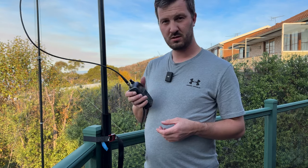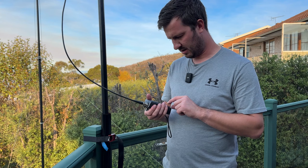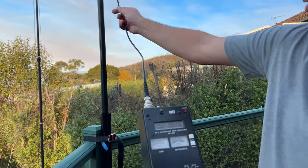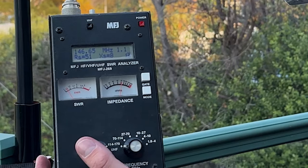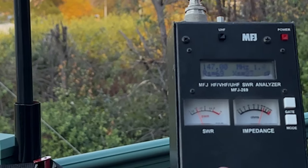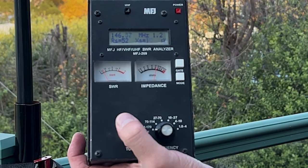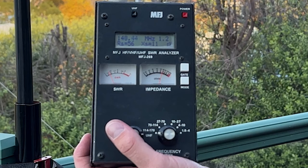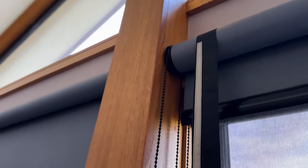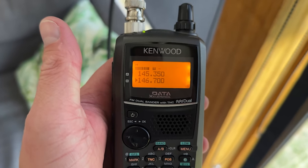That works. Testing — I'm getting into our local repeater okay. Ben's not wrong, you do need to hold it pretty straight to get decent tuning. If you get any bends in it — look, as soon as I let go of the coax the SWR goes up. So you can have a weight or secure it at the bottom, but it's pretty flat across two meters. 148 down to 144. I've even just hung it up in the window — the repeater usually gets a little noisy here in the lounge, but look at that, it's noise free.